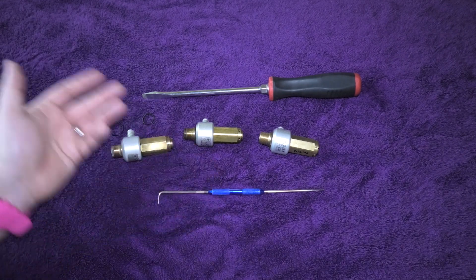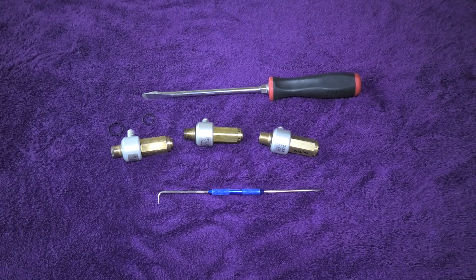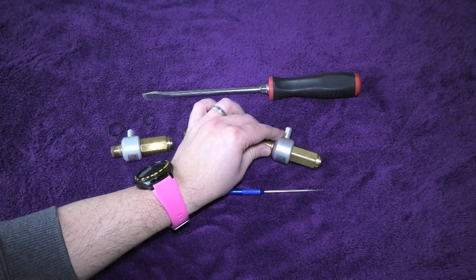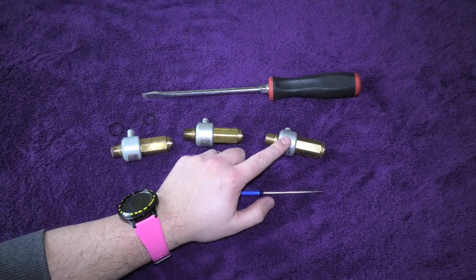I've been having a few issues with mine — as you can see I've got three of these here. This is not the first time this has happened. What happens over time is something inside wears, and when you're dealing with full pressure, over the course of time the trigger will start to cut in and cut out like it's pulsing. Obviously this can be an unloader issue, but if you've got water coming out of the bottom of this output hose here, you would normally find that there is an issue with this safety relief valve.